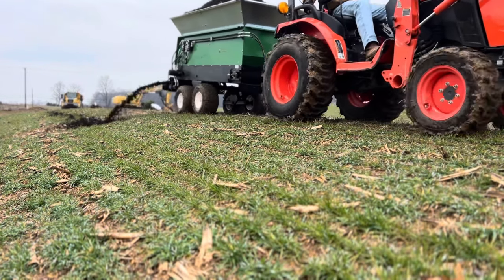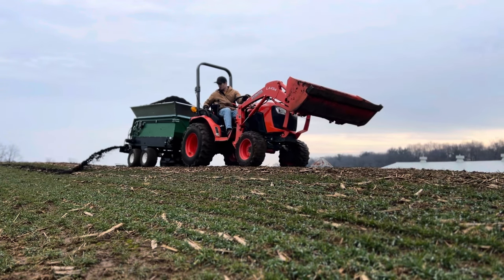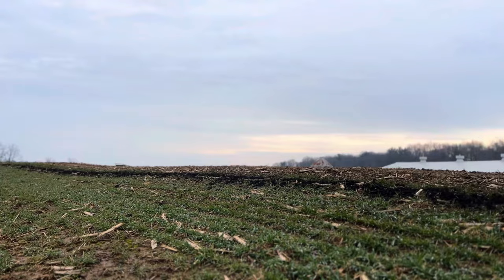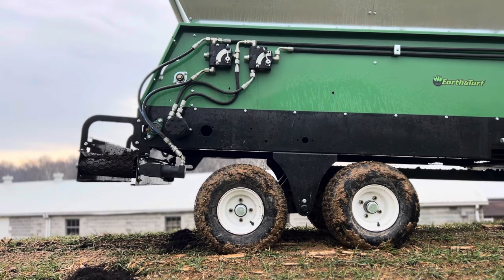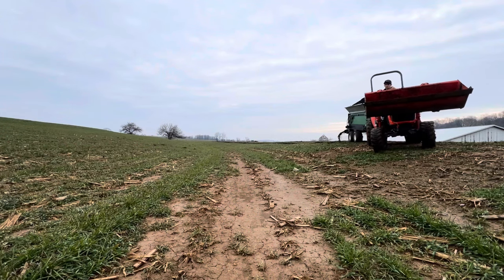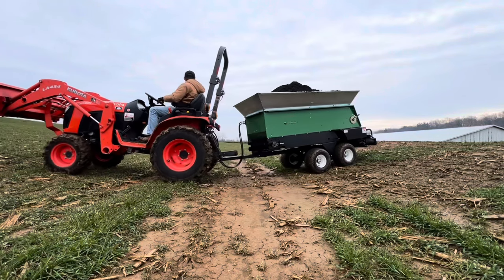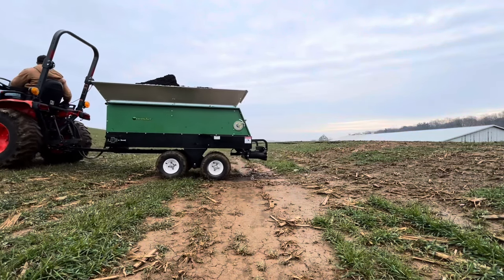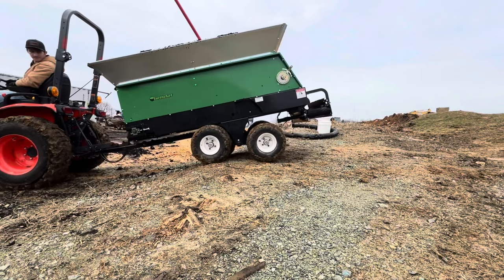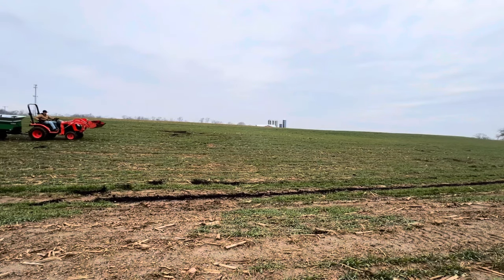These are the main features you're going to find on the 320V. Some variants like the 320H or the 220H with side conveyor will be a little bit different, but the controls will be mostly the same. I'm going to run this out on the empty field and point out a couple of features important on this model. This one has the tandem walking axle — you can see the two wheels right there and they're a little bit more stable. You can see I'm pulling into this dip, and notice how that walking axle just handles the hill. Going empty down over this little berm in the material yard, you can see how that axle handles everything nice and slow, nice and stable.